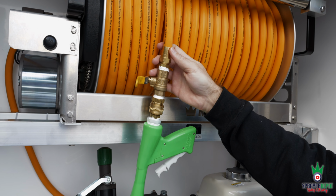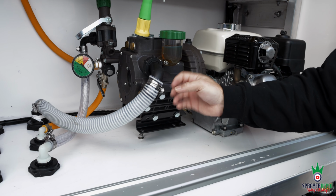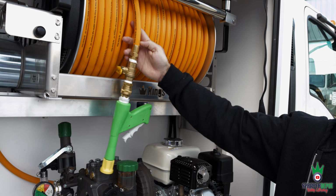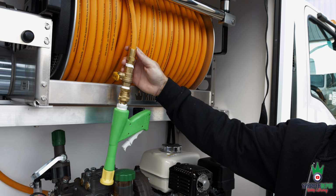Anything on the discharge side, we don't use a clamp. Can't really prevent it on your suction. You're going to have clamps, going to heat them up, get them on there tight so it doesn't suck air. But up here, if there's a clamp here, it can slice your hose, it can cut your hand. Safety issue, so you always see a 2-piece compression fitting.